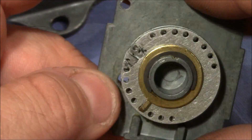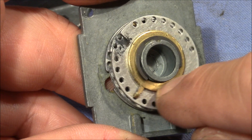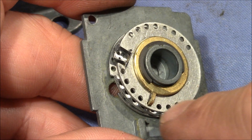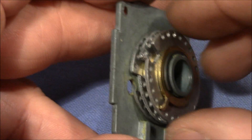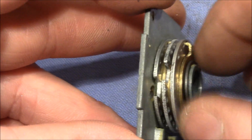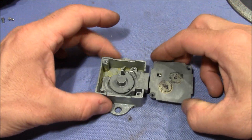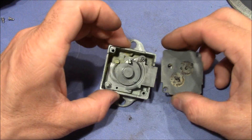With these holes here you can change the code. The inner wheels - these brass parts relevant for the code - depending at which position on the outer wheel you place them, you get a different code and have to do different turning motions to get all three gates aligned. It's a very interesting mechanism, very cool to inspect, and very safe - that's why they call it a safe, I believe.